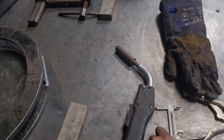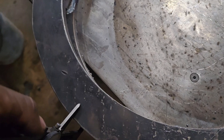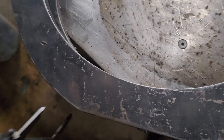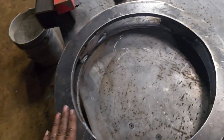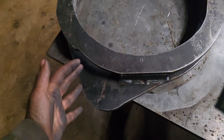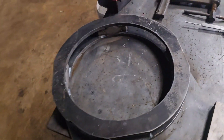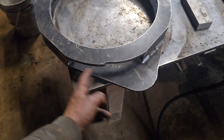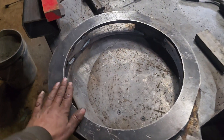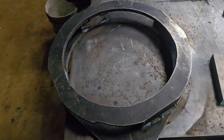After measuring, you can see that this thing shrunk a little bit into the centers where it was unsupported. If I was making this for a customer I would have just had a two-and-a-half inch plate flame cut out and then ground. I'm just trying to work with what I have, so I think this will do. I probably should have added inside supports and tacked those in before welding — that might have also reduced the flex — but I think it'll be fine once you put it in the machine and surface it down with a shell mill.